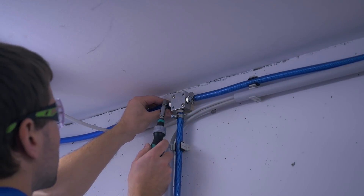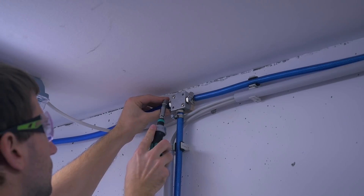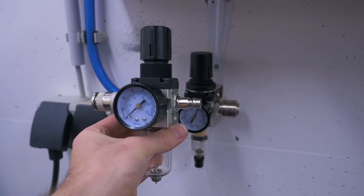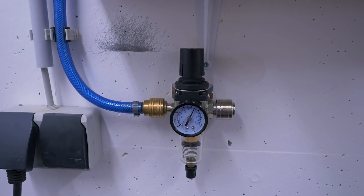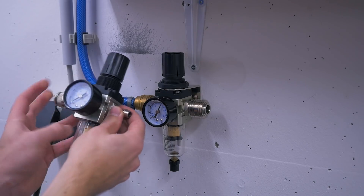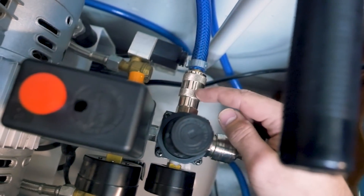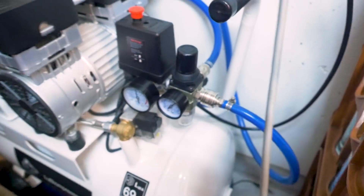Is there a leak? This was just not tight enough — okay, so far so good. The leftover part of the hose I can then use to hook up the compressed air to the pneumatic stuff of the CNC router. One more thing about the pressure reducer you might not know: they usually always have a side that's the inlet and one that's the outlet. Every single one I bought was configured so the inlet is on the left, but for the new one I needed it on the right. That's totally possible because on the back there's just a plug installed — swap the plug with the pressure gauge and turn it around, then the inlet and outlet are also swapped. Or you can also use the back with another quick connector — you just need one that has an eighth-inch pipe thread and then you can install it and have two outlets at the compressor.